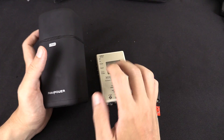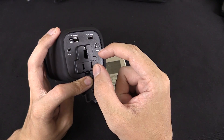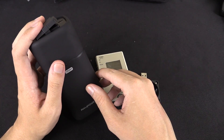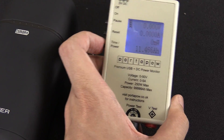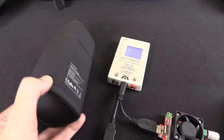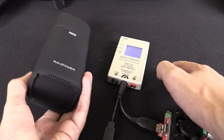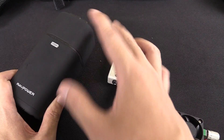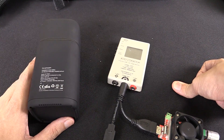Normally you'd expect around 10 to 15% losses because you're going from 3.7 volts of the internal battery up to 5 volts, but that's basically 23% off the advertised rate, so I'm not very happy with that. I'm going to fully charge the power bank and do this test again, because I'm worried I may have left the AC inverter turned on, which always consumes power even if nothing is plugged in. Through the magic of editing, I did the test again — we got 56.383 watt hours, which is pretty close to our first test. That means it's about 25% away from the advertised rating, and normally we expect only 10 to 15% losses. 25% is just too far off — I'm not very happy about that at all.